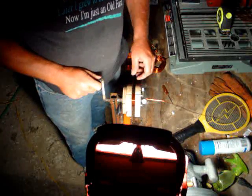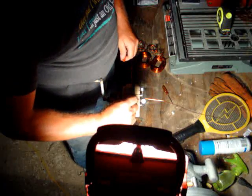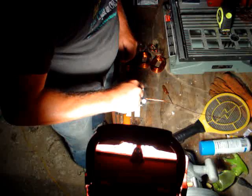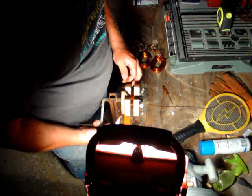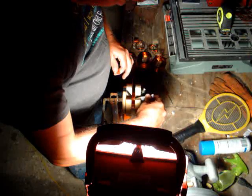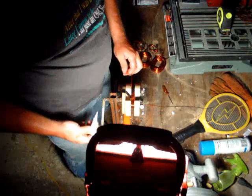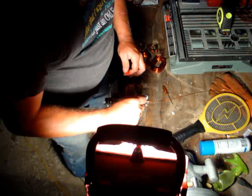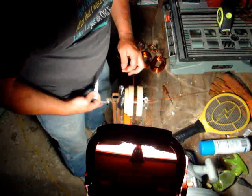We've got the first seven windings on already. What I'm going to do is put a line of super glue. I've waxed the whole form inside and the sides. I'm just looking for a drop in between each of the wires here at the top and where this starts coming across. I'm not trying to paste it to the side, but I'm going to put some through it and let the capillary action work. Capillary action is where you put a drop on something and if it's fibrous it absorbs, kind of like paper towels.